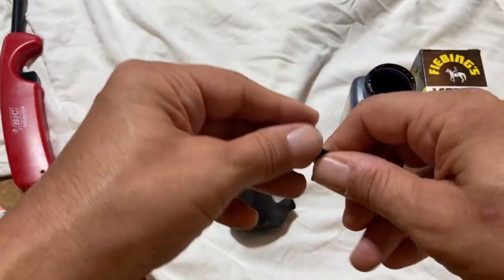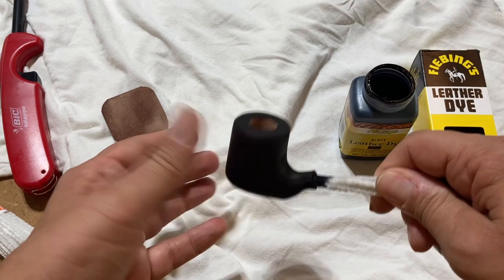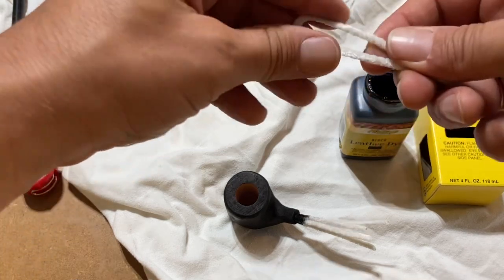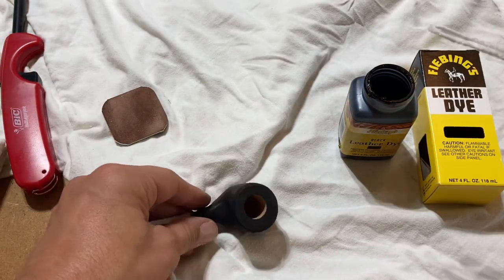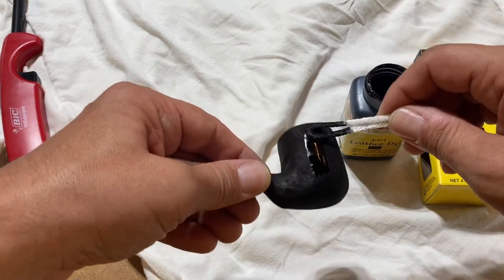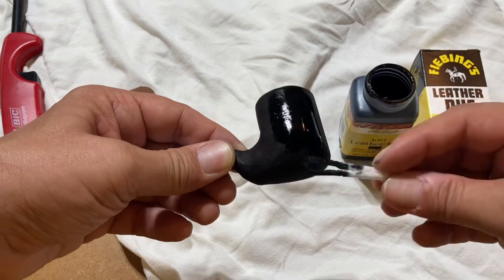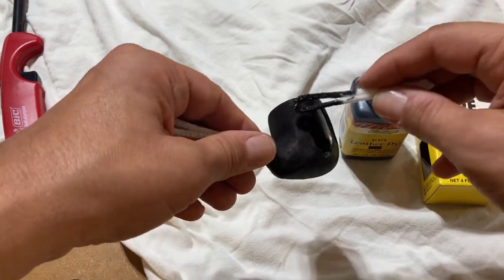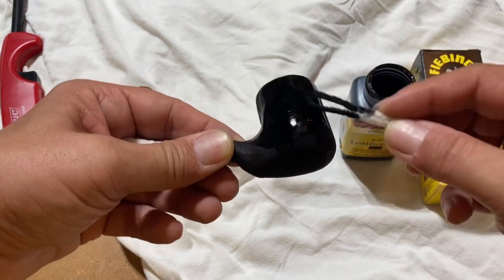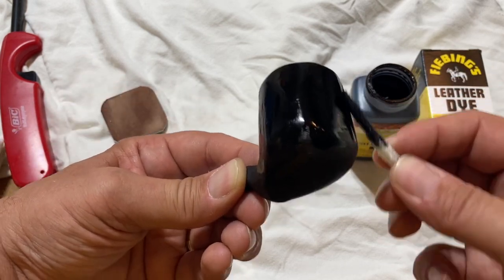So got a couple of pipe cleaners, and we're just going to put those in here just as a kind of something to hold on to, using another pipe cleaner. Bending that in half, and really just going to paint this on. I've already done several coats. We're going to do another coat here, and you can see it goes on very nice and wet, very shiny initially. And in between coats, I've sanded. We'll talk about that here in a moment with one of the micro mesh pads.